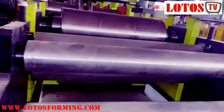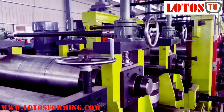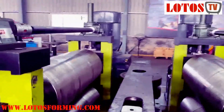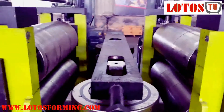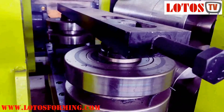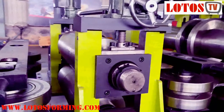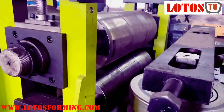This is the input table — non-powered. Since on this machine the customer mainly wants to do 6 millimeter and 12 millimeter, it has to change the roller gap. We use this kind of elevator with a hand wheel — it will lift up the roller gap. This unit and this unit we call the feeding guide. Between the stands we also have vertical rollers to guide the sheet position. The insert material is not coil material — it's sheet material — so we have to guide the sheet through the roller without moving.